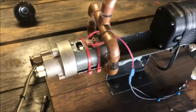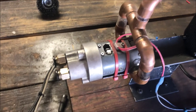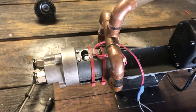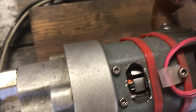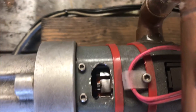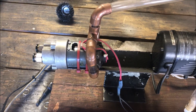You can use this thing for everyday tasks without needing the cooling system, but anything beyond that you're going to start fires and burn up your electronics. This pump doesn't need a cooling system if you run it at 12 volts and the four or five amps it suggests — but what if I want to put 150 amps into it real quick because I need a fast 500 psi? Got to have the cooling. I actually have a video testing the amperage capacity of wire that thick — you can get 50 amps through a wire that size and it glows yellow hot. I'll try to find it and leave you a link.